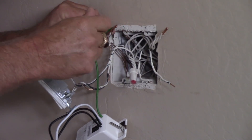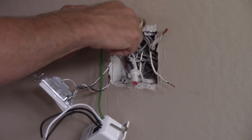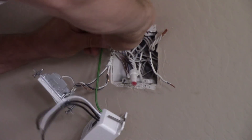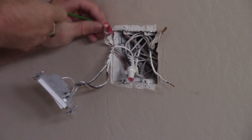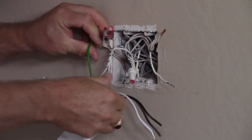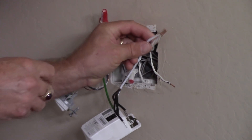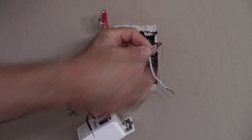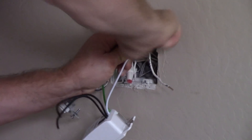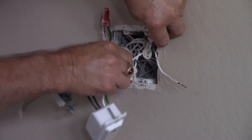I'm ready to tie this ground wire into the ground splice. You want to make sure the wire is even with the ends of the other wires, then start spinning on that wire nut. Make sure the nut grabs that stranded wire to the switch as well as all the others — I think there's four of them here. Pull on it to make sure it's firmly in that splice and can't be pulled out. Then your neutral wire, same thing — tie that into the existing splice. Line up the ends all even, put the cap on, start spinning with a little bit of pressure just to make sure the stranded wire gets into the splice. Tighten that nut down and again pull hard on that white wire to confirm it's in there solid.